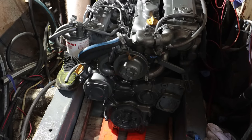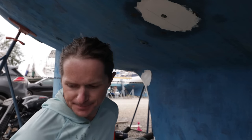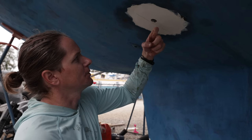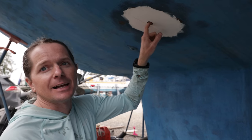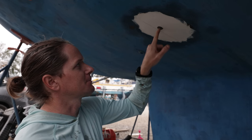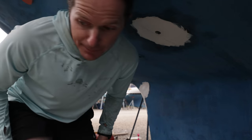Because of my earlier mistake cutting inside out, the through-hull is not in place and the engine is already in the bay. But the good news is the new engine is a lot smaller, so we have pretty good access to where the through-hull goes. We're going to install it right now before we finish the engine hookup. What lesson did we learn? Drill from the outside in — the drill bit shears on the back side of the cut. When I cut from the inside out, it chipped. Drilling from the outside in, any chips would have been on the inside and been fine.